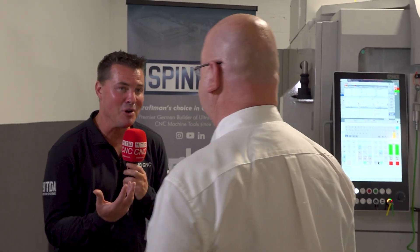You just unlocked a key memory for me. Back when I was running turning centers and we were machining jewelry — gold, platinum, silver — I was burning through brushes trying to run my live tooling longer than they should have been run, and that was expensive in time and maintenance.